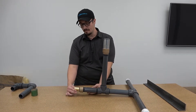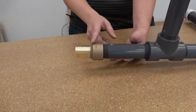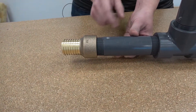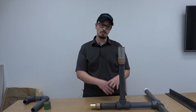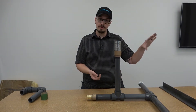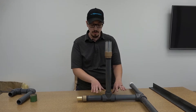For the pipe connection, we've got a barbed male or female adapter making that plastic-to-metal transition — we want to thread the metal onto the plastic so we never have to worry about the pipe splitting. We're building this thing to last a long time, and you don't want to be dealing with problems especially when it's way out in the lake and hard to access.